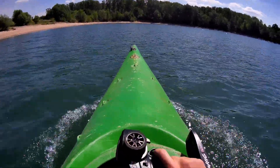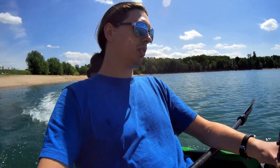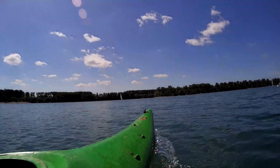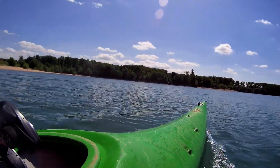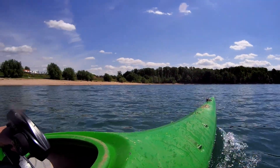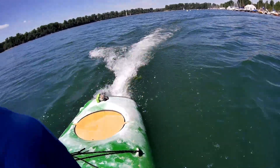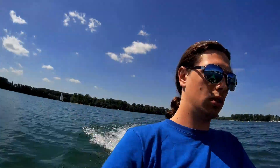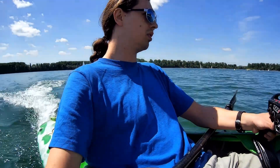As we can also see in this clip, the overheating gets frustrating quickly. The amp draw is not really the problem — in the last test I already figured out that even when the jet is dragging in the water without the right plate, it only draws 140 amps peak. But the controller's heat sink is just too small because it's a very compact design made for small RC boats, not for kayaks.